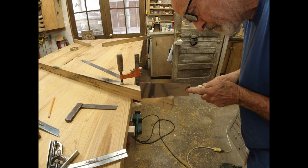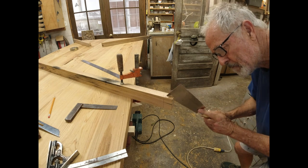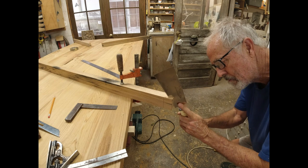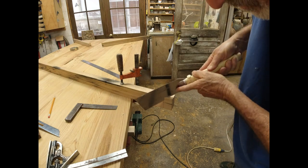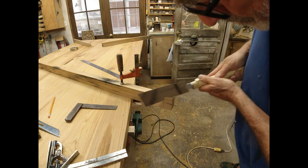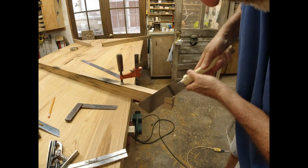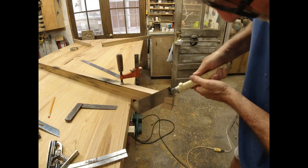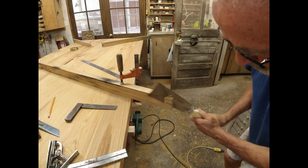I'm cutting the ends of the long center section — I think they're called stretchers, the brace that goes under the table. It's more than 45 degrees so it doesn't really work on the miter saw, and for the same reason it doesn't work on the table saw because most table saw miter gauges don't turn that sharp. So I'm using a handsaw. Handsaws are great — they probably make more accurate cuts than power tools because with a handsaw you can look at it as you go. My problem is I don't see that great and my hands shake, but in this case it worked out really well and I got some great joints.